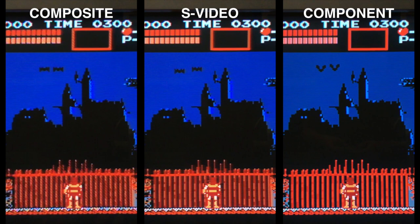Interestingly, you can see a little bit of a problem with my TV on the component video output. The red of the fence is too red and you can't see the two tones very clearly. The red push is a bit of a common problem with these Trinitrons — I still need to go into the service menu and turn that down.